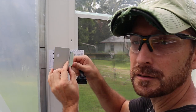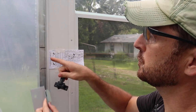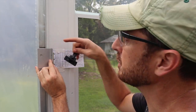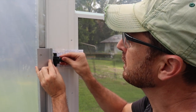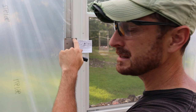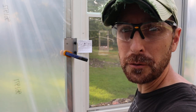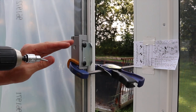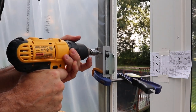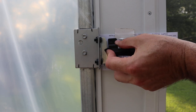You have to have this extra piece that you can adjust to catch the latch, because the latch sits an inch and three sixteenths away from the edge of the door — which is actually fairly far — so this piece of angle needs to be big enough to catch and hold the latch. We've got our little bracket made, and now I need to attach it to the frame using the same self-tapping screws used to build the greenhouse. I've got it marked out and held in place exactly where it needs to be in relation to where our template is on the door. Now you can see our modified bracket with the catch aligns with our template and door handle.